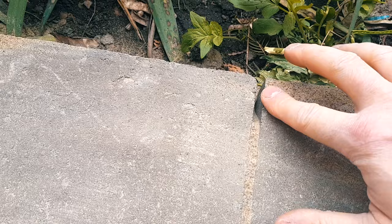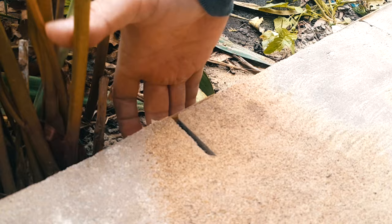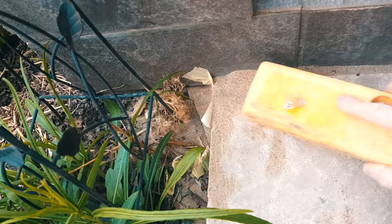To get the polymeric sand inside these edges, that's always a difficult part. What you want to do is get some tape on every edge — that way when the sand goes in it's not gonna trickle out. Use paper tape on these kinds of pavers, or gorilla tape, though paper tape is probably a better bet since gorilla tape is really sticky. Wrap it underneath so the sand doesn't trickle under, then push it through. Make sure you get all the sand off the pavers so when you put the water on it doesn't dry up on them.